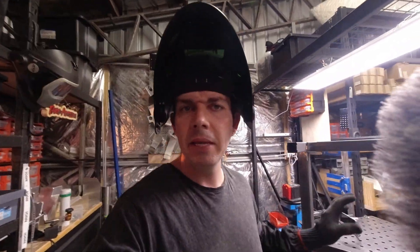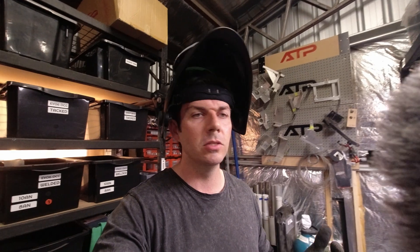It's the final inside corner joint. I think the weld assist feature is amazing on this job — two millimetre mild steel. All I did was put in the metal type, the thickness, and the joint that I'm trying to do, and the machine was dialed in well enough for me to make very decent welds. It's certainly got full penetration and certainly got good quality welds. A little bit of fine tuning to improve aesthetics, but all in all, to have a machine that gives you a ballpark right out of the box I think is bloody awesome.